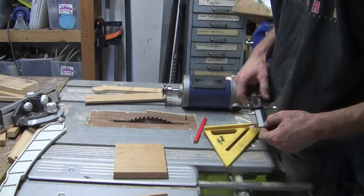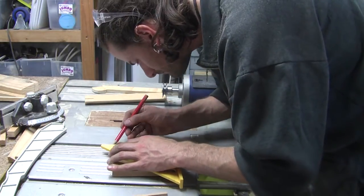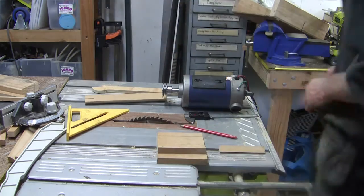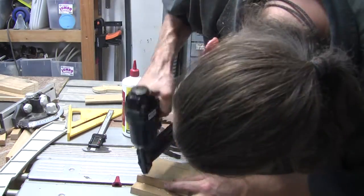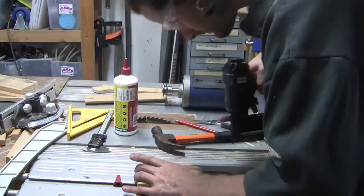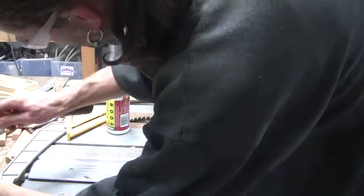So here I'm just measuring the centre. My first batch of lines went a bit off because my pattern isn't quite square, which doesn't particularly matter because it'll be milled down a little bit, and for the application it's being used for it doesn't really matter anyway. I'm just taking one side down and putting a nail on the other, lining it up so it's parallel — which I end up having to adjust a little bit anyway, by just putting the motor inside and making sure it had no twist.